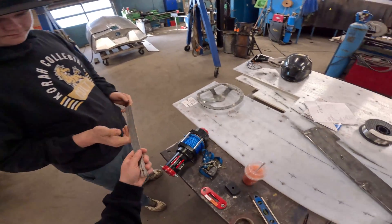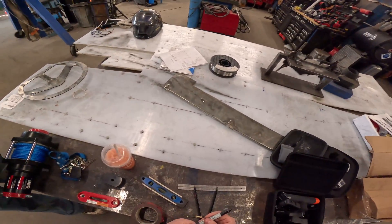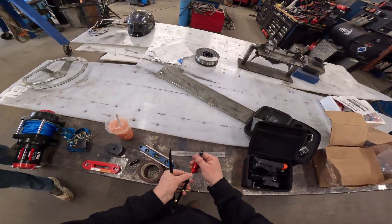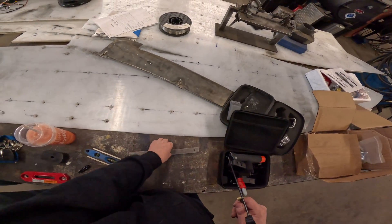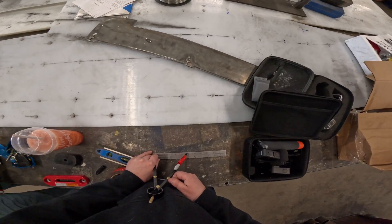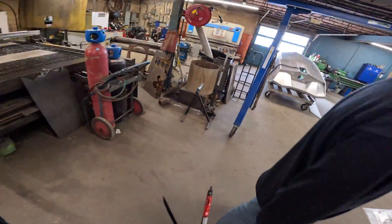So what we're going to do is put that ruler down. We know that our measurement is four and seven-eighths to center. We're going to tape the marker on and then mark it so it's four and seven-eighths to center. I'm going to mark it on the one — actually, that's 11. So now I'm going to go to five and seven-eighths because it's not four. Now what we're going to do is double-check our work — check the other side that we already marked.